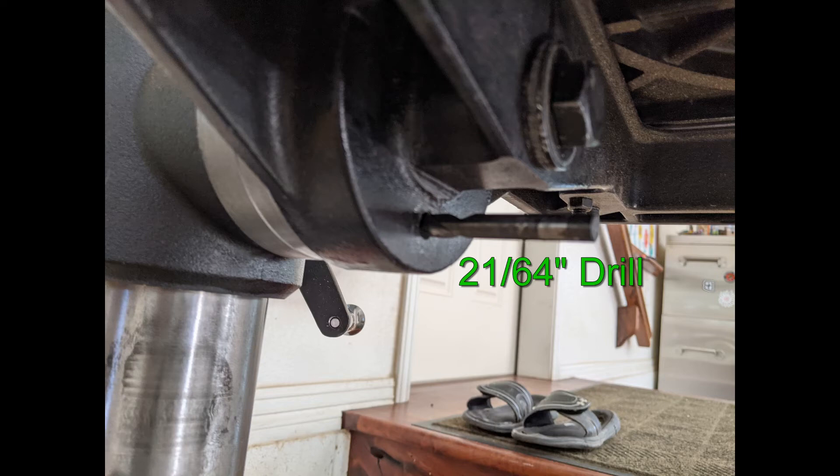With the table set perpendicular to the drill chuck axis, I removed the locking bolt completely and inserted a 21/64 drill bit. That's a pretty snug fit to the threads of the 10-millimeter threaded hole in the casting. I hooked a drill to it and drilled it out — the bit is nicely guided by the threads. This basically reams out the receiving hole in the mating casting, giving a precisely centered hole with respect to the threads when the table is in its correct zero-degree position.